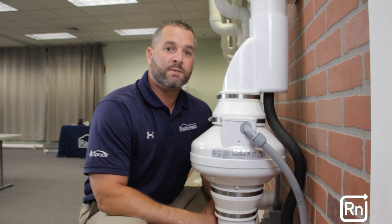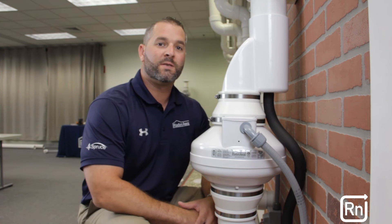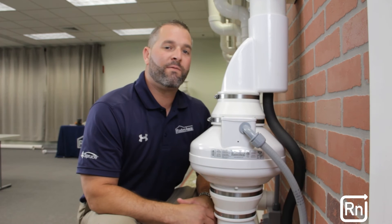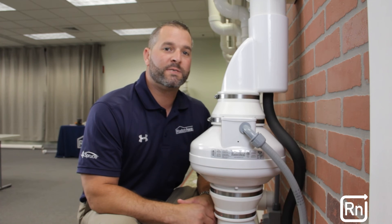The EC6 was developed and designed for a 6-inch pipe; however, a 4-inch pipe is commonly used as well. When using the 6-inch pipe, the max operating pressure is 4.25 inches and it moves 514 CFM at zero static. While using a 4-inch pipe, the recommended max operating pressure is 4.75 inches, and it moves 341 CFM at zero static.